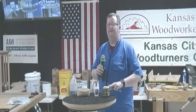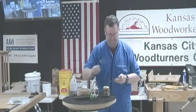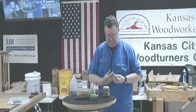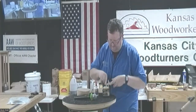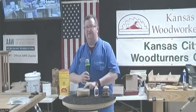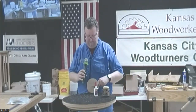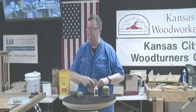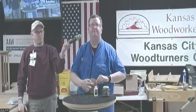You'll make your piece whether it's on a face plate or a chuck, however you're going to do it. You're going to measure how wide this is. It's actually best to use a compass — this is what I have so this is what I'm going to show. I'll measure from the center out to the outside edge like so. Then I'm going to go over here to my piece and mark out a line here so I know where that's at, and make a circle around this piece with my compass.